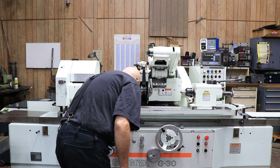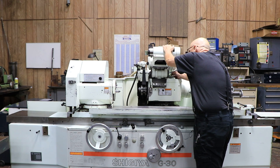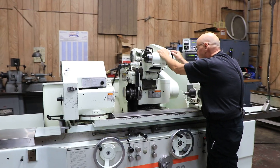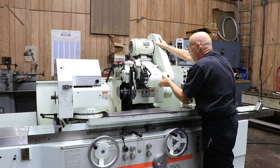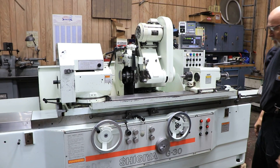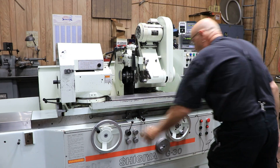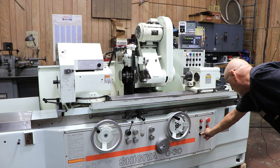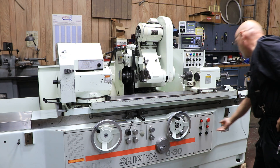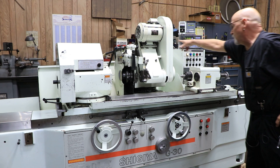You've noticed this ID attachment hanging here. It has a pin on the side you can pull out. As soon as I move this, it's going to automatically shut off the grinding wheel. Then you would bring this down — there are a couple of bolts here that you would secure in there. You could traverse grind automatically. I'm going to move my dogs close together, turn my table on and go from plunge over to traverse. Now you've got to start the machine again — the hydraulics will start up and everything. It's going to be this motor, not the external motor.